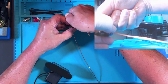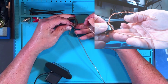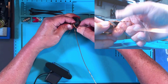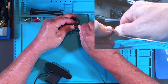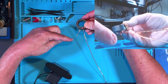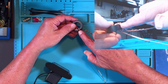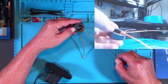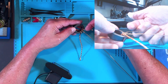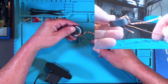Now I'm going to begin tightening across the top of the toroid, keeping the bottom bent in this direction and making sure this stays off to the left. This is the hard part — once you get to the single strand, you're going to be just fine. Coming across the top now, that's considered wrap number two. I don't go back through the toroid. So now I've got my inch and a half piece coming off to the left, the double coming off to the right, and two wraps across the top.